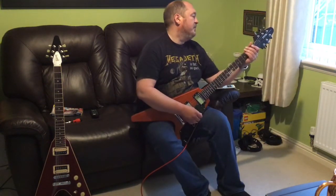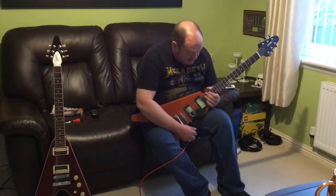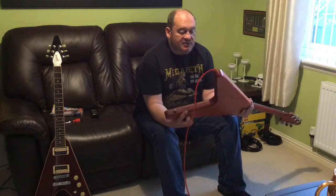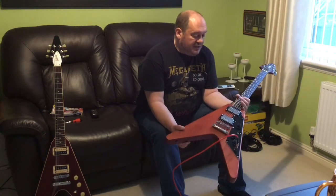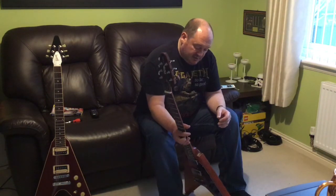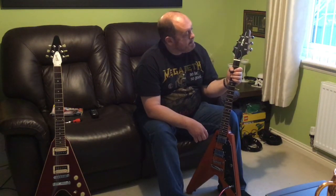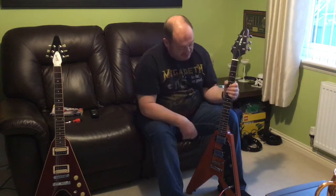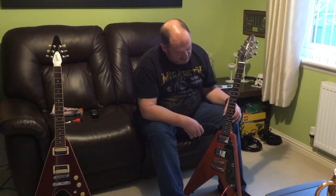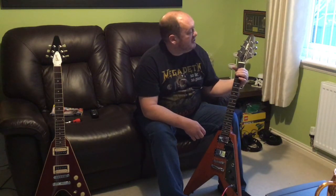Good. Yeah. So that was another one. I don't know who the manufacturer of this kit is. I wish I did, because I was seriously thinking about buying another kit from whoever it was. It needed a fair bit of sanding around the edges, but there was nothing needed done to the neck at all. Didn't need shimmed in any way. Fitted great. Headstock was all cut fine. Just some issues with the hardware. I've changed the nut, obviously, as you do in these guitars, and tidied up the fretboard. Even the frets were pretty much bang on level. They only needed a very light dressing around the side, so very happy with this one. This has turned out nice.